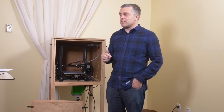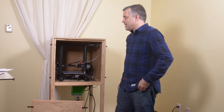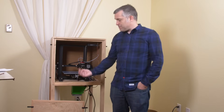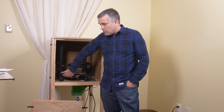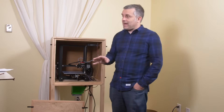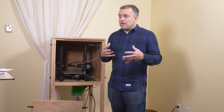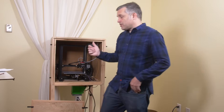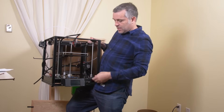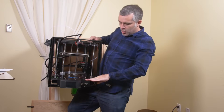The BL Touch sensor uses a magnetic sensor — just like the Pinda probe on the Prusa — except instead of measuring the bed itself it measures a small magnet attached to the probe. So out with the sensor; I went back to manually leveling the bed using the knobs underneath, replacing the big plastic knobs with metal ones. Everything plastic is suspect and likely to warp — you want as much metal as possible for the components that matter. A better printer candidate would be the Two Trees Sapphire, which has all electronics underneath a subfloor, stepper motors below the floor, and a fully metal linear rail motion system.